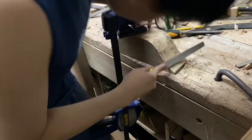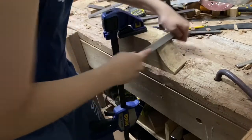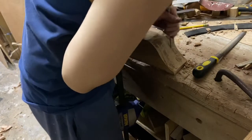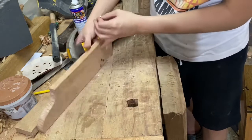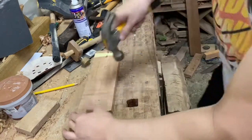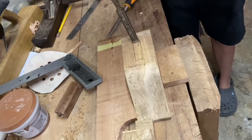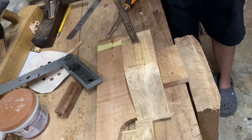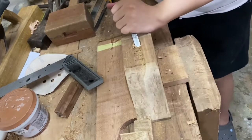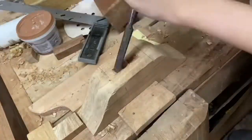I also thought it would be cool to add a circular detail, so I added that in. You can clean curves with a file or wrap sandpaper around a dowel. Using a spokeshave would be good but mine can't handle a curve that steep. I pound in scrap pieces with nails to make a temporary holder so I can cut the mortise. The mortise is about 3/4 inch wide, 2.5 inches long, and 1.5 inches deep.